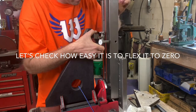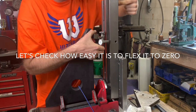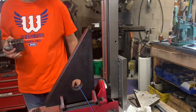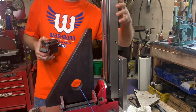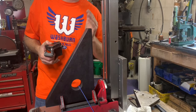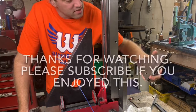By pushing with my finger I can get 5 thousandths — it's pretty light pressure, so I'm okay with that. Actually, with the weight of the head on here, I think it's a good thing to have this leaning back. I've read that some others intentionally set it this way because it comes forward when the weight is on there. So that's all for now. Thanks for watching. Next I'll be working on getting these mounted up.